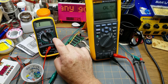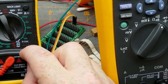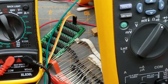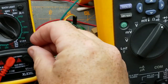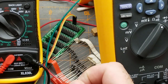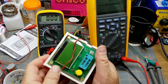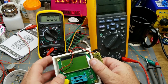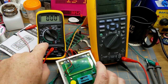The other thing this meter has is a little transistor tester. I don't like those on meters — they don't tell you very much, and you need to know what pins you've got on an unknown transistor before you even plug it in. You need to know where the collector, emitter, and base are. If you actually want to test transistors, just get a dedicated component tester — it'll tell you the gain, the pinouts, and whether it's NPN or PNP. This transistor tester does none of that.